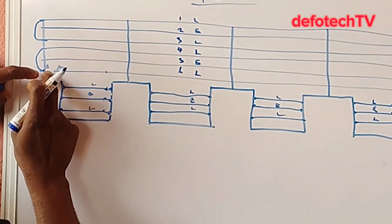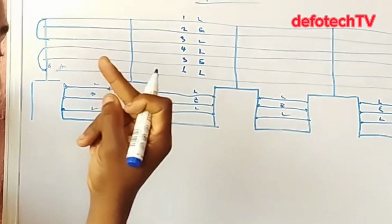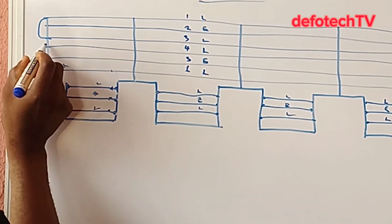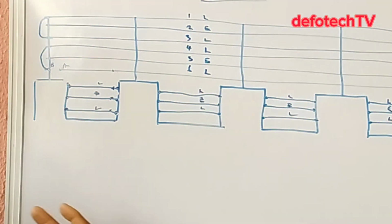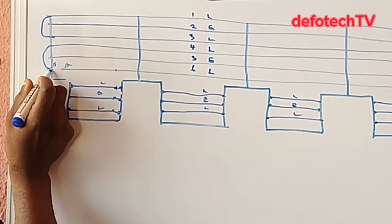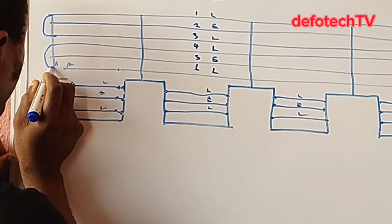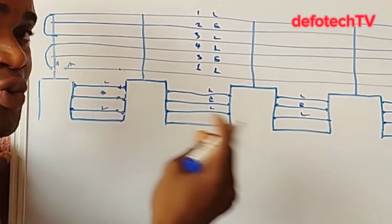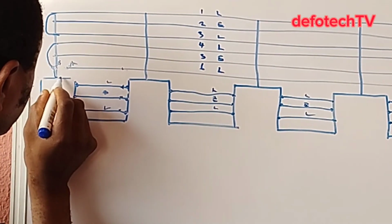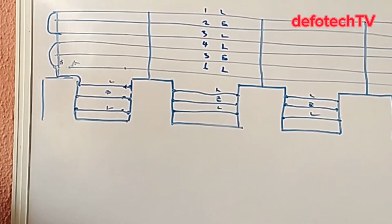There is no more connection between this wire here, the spring, it stops at the beginning of the spring, and this bobbin here. You have your bobbin on the fence here, and since your bobbins are insulated, when this one gets here, I want this one around the bobbin. Then I can come here and take this wire, link from this loop through using an HT cable. I'll bring this wire through this fence, HT cable, to this line.